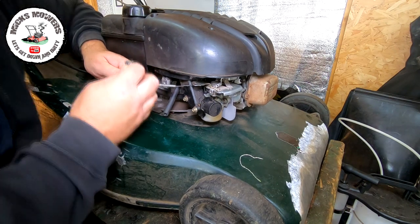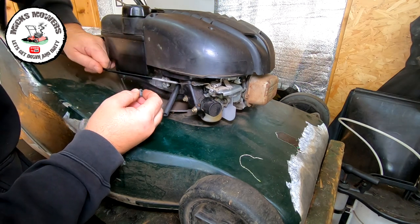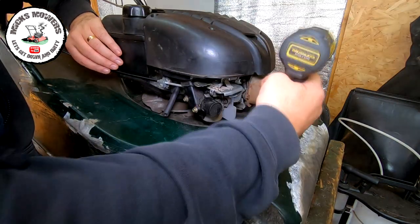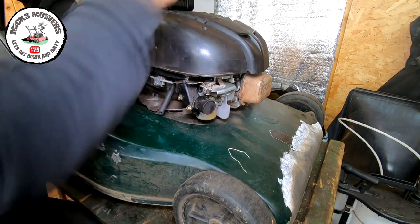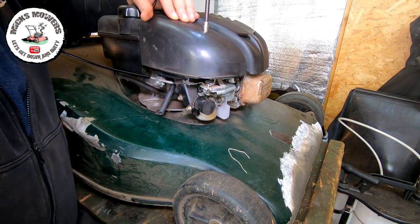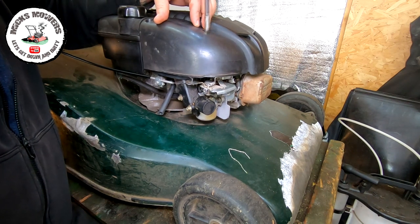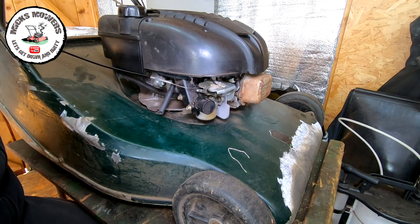I'm now going to choke this machine by hand. It's set to choke up the top. So now I just want to set this choke by hand — pull this cable back. Some of you were asking how to set the chokes on these. That is about full throttle, but if you pull this choke all the way back, that is now fully choked and that's where the cable wants to be. I do that up, and this up as well. Okay, the airbox is now in. Set to choke, half throttle, idle, stop — now it's doing its job.